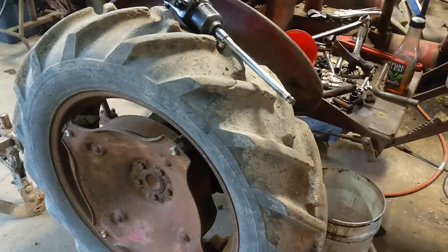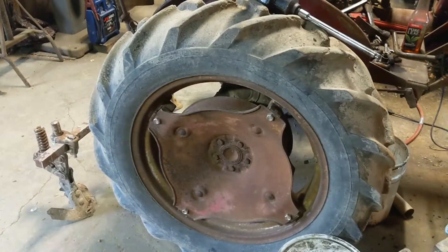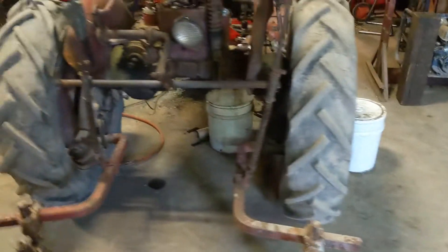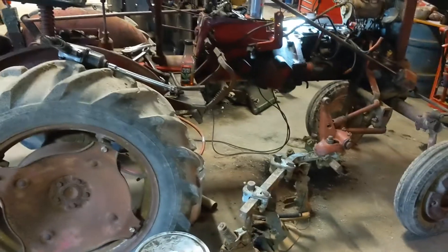We use this for a tree nursery, so it's got the cultivators on it — well, half of them now. I had to take some off to get the oil pan off. We cultivate nursery fruit trees we grow. This thing was just a bit too wide for our planting, so when we first got it I built some custom spacers to set the tires in just a little bit, because out there the wheels stuck out too much and would snag the row of trees next to it. PTO still works on this thing — used to leak all sorts of oil, but that's mostly gone now, which is quite surprising. This thing is a 1948 and I can definitely say they do not build things like they used to.